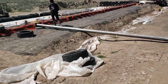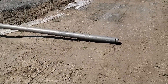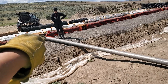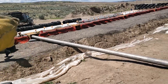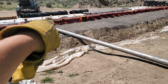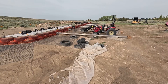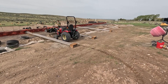Here's the plan for the cooling pipes - not culvert pipes, but air conditioning pipes. We've got our boxes doubled up and basically just slip the pipes through. We've got a slope - probably going something like the standard plumbing slope of quarter-inch per foot of drop, just so that no water will run in. It's 25 feet total and we'll have another box there, and the slope of the house will essentially come about there.